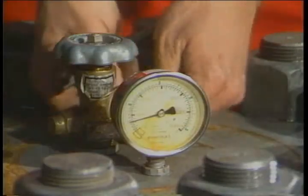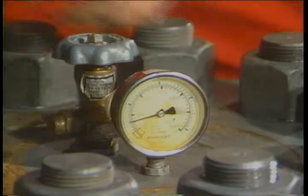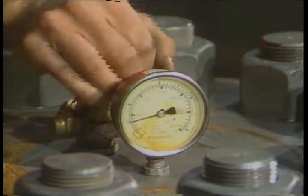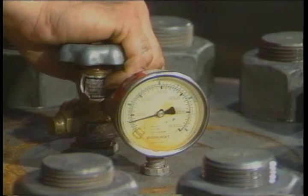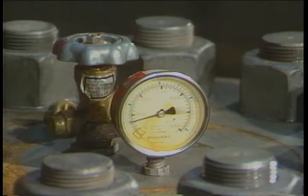Now you need to depressurize the dampener. Take an open-end wrench and open the valve outlet, or purge valve on the Continental. Then, open the valve by hand. It's okay to vent the nitrogen into the surrounding area, just don't directly inhale the escaping gas.